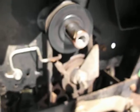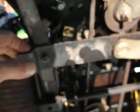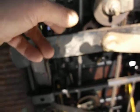If you can see that without my big body shadow in the way there, I'm getting as wide as I am tall. This belt is around the steering column. That means this has to come off, and the steering linkage. And then you can unbolt this, slip it down, and the pulley has to get unbolted here. Which also means the rest of the body has to come off in the back, and the fuel tank, to be able to route it down there around that big old pulley. Because that critter's going to gag you all the time. And so is this mechanism right here.